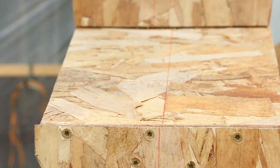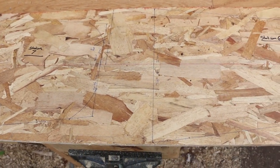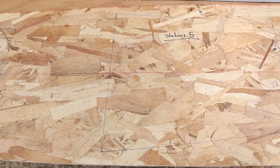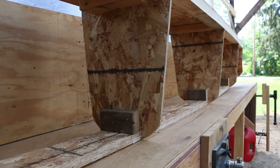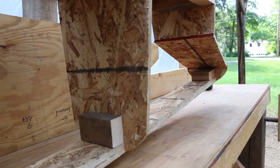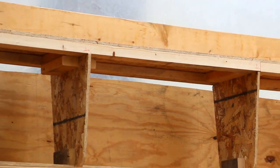At this point, there are several different ways that you can do this. Many people choose to layer boards and make a single block out of them, and then shape that entire block into the shape of their keel. What we decided to do, and thought would be much cheaper, was to build the mold out of the shapes that we've printed. We're then going to build it out with rigid foam that we salvaged and shape that to the final dimensions of our keel. Once that was done, we would cover it in fiberglass and we'd have a solid structure.